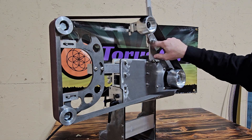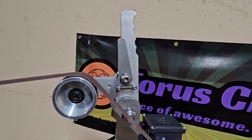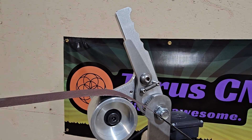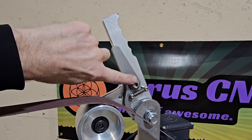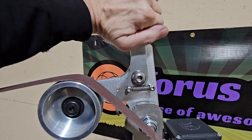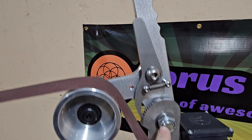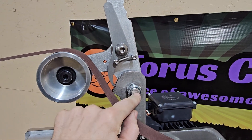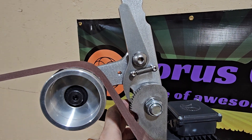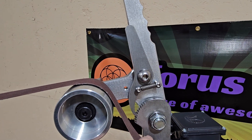As before, I've got your ratchet mechanism here — ratchet pawl. I upgraded those all. Just fairly recently I've gone to using a half-inch pivot here for the ratchet pawl. Got your stainless hardware as usual in there. I went to a three-quarter inch pivot with three-quarter inch thrust bearings behind there. This has got the half-inch thrust bearings. I just like the bigger footprint for that to give it more rigidity.